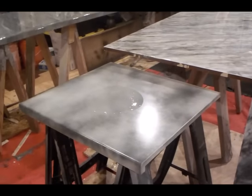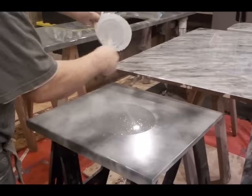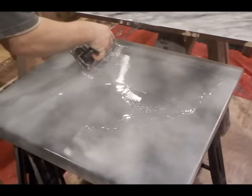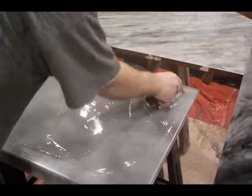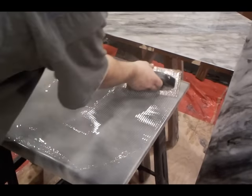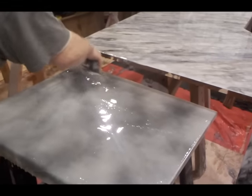I'll do the same thing — take my stick, pull out the extra. The reason I pull out the extra, even though I have enough to do the top, is so I can mix what was on the sides of that bucket. Same thing: I start in the center and just pull my trowel out towards the edges. You can find this material at StoneCoatCountertops.com — it's been formulated just for this application. It works really, really well and it's user-friendly. I love working with this material and the results are just phenomenal.